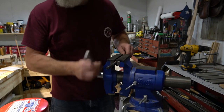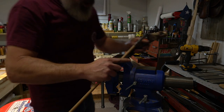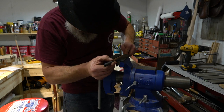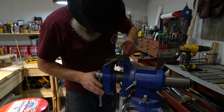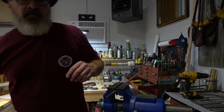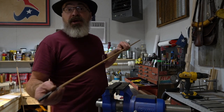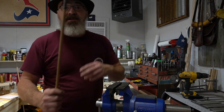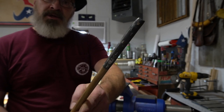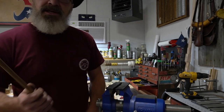Pin that with a ball-peen hammer and hit it with a little bit of a file. Like I said, this can be done as neat as you want to do it. For a nice Pennsylvania rifle you're going to want to do it neat, but for the purposes of this wiping stick for the type G trade gun, we want it basic. So that's it — that's that side. Now we're going to do the handle part.